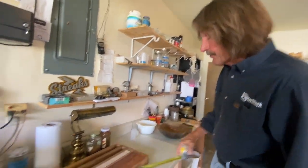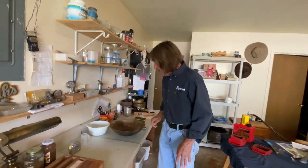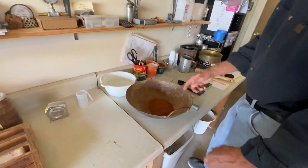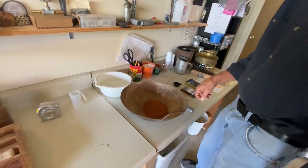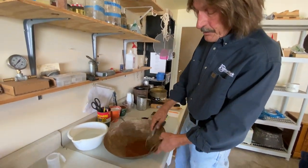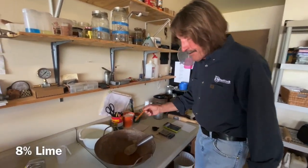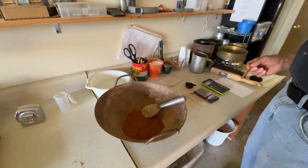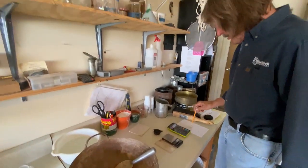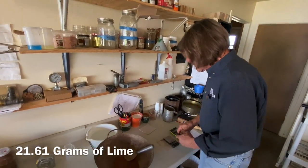This is an old sample from long ago, but we did all of these blocks — these are just soil blocks, these are all cement stabilized. Today, for science, we're going to make a couple of lime stabilized blocks. We've got the same three to one mix here, mixed until it's all the same color — that's what you want. We're going to do eight percent lime in this mix just to see what happens from a stabilization point of view. That requires 21.61 grams of lime.